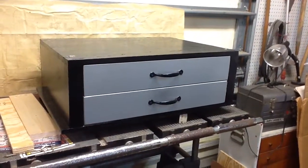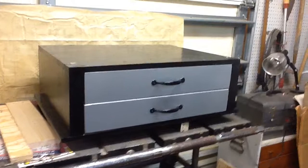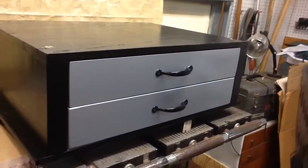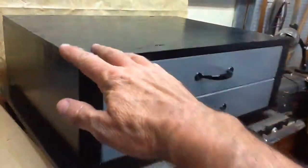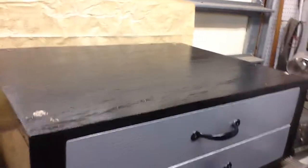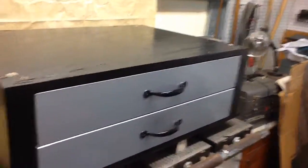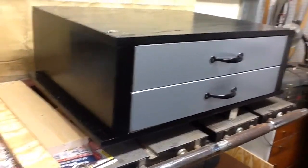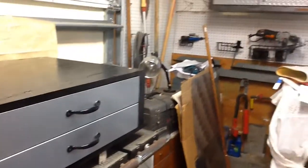Hey everybody, here's the painted mini mill base. Wanted to show that. I don't have the steel on it right now, the big 3/8 inch thick steel plate, but you can see the holes drilled and then screwed in 6 3-inch long 1/4 inch lag screws to hold the plate down. I'll carry them separately to make it easier, but just thought I'd show this in case anybody wants to make something that matches somewhat a Gladiator.